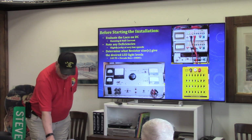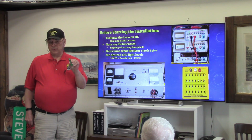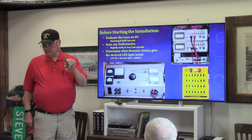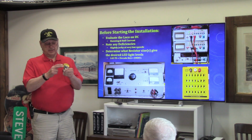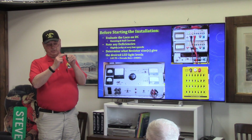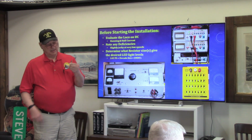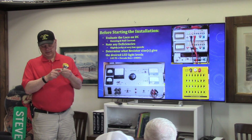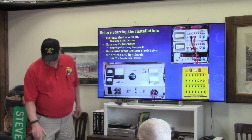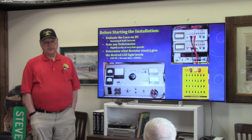The board that came in it has an 8-pin connector on it for the old first DCC ready connections. And on it, basically, they had the front and rear pickup wires to 2 tabs. They had the motor to 2 tabs and the headlight to 2 tabs, that's it. But on the board, I noticed there's a 500 ohm resistor and a little cap along with the diodes, and that allowed me to play with it.